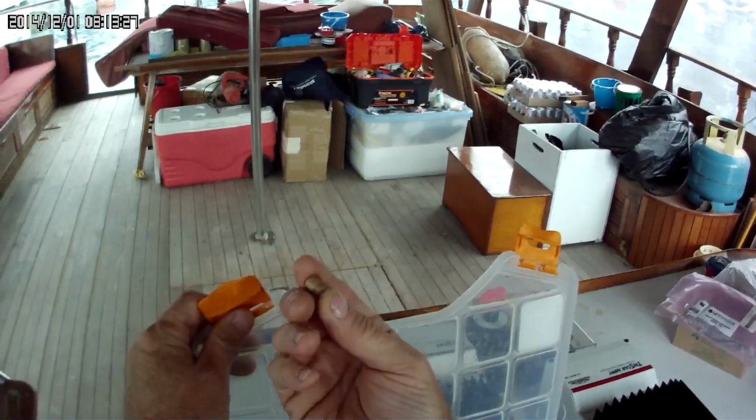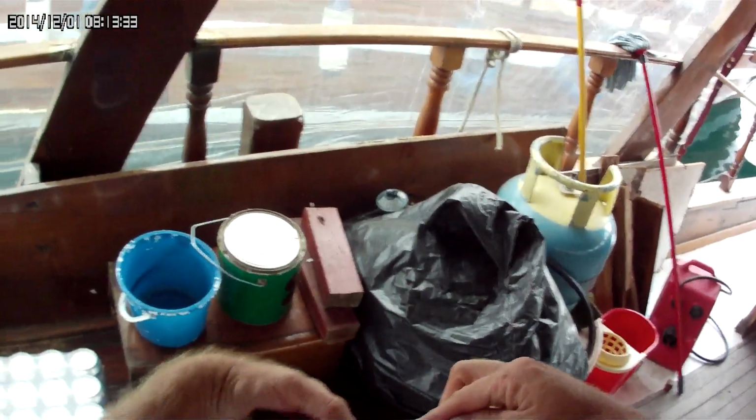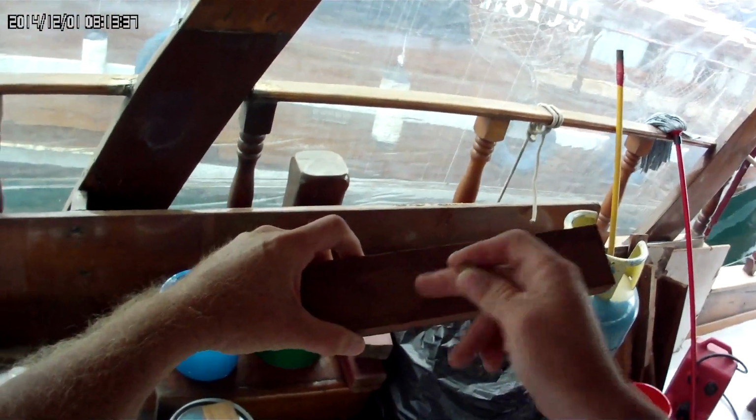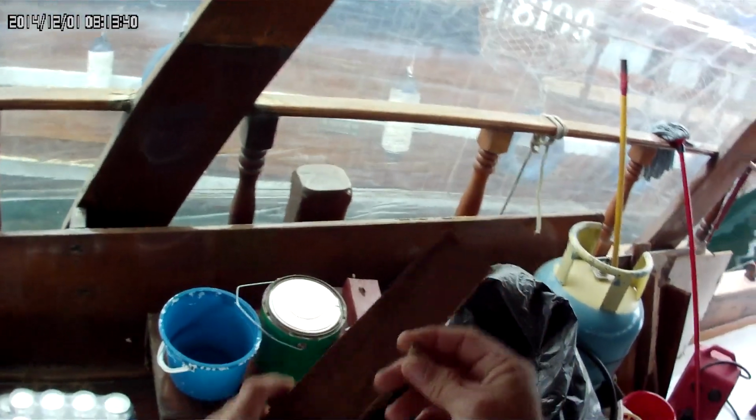What you do is you get spare wood, and you take it on your drill press. Like these are spare, but what you do is you just drill into it, and then you take a little screwdriver and you just kind of snap them and they pop out. But I just make my own plugs. I bought the bit. I think it was like $2 or something like that. But anyway, that's how that works.